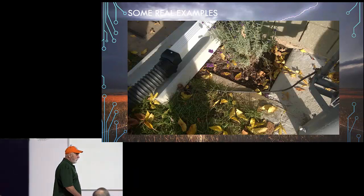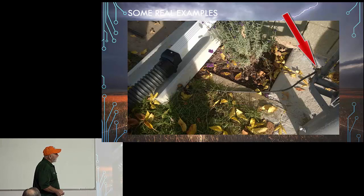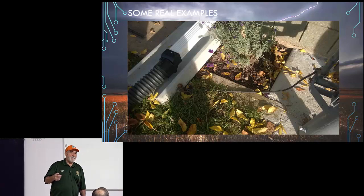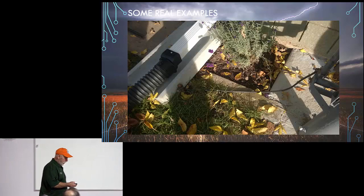The key thing on this one to take away, and it's hard to see in this picture, is that I've got a really heavy old jumper cable that connects over here to the base of my tower and runs over here to a ground rod. And then I have two other ground rods and everything is bonded together. But because I can't find the service ground, I can't bond to it because I don't know where it is. But everything does go back to my service panel, which I'll show you a picture of.